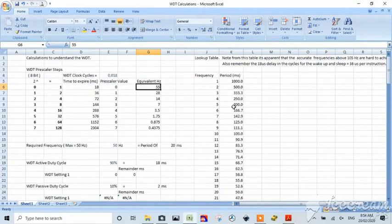So you could keep this going right down to 500 hertz. Let's say we want 500 hertz. So now we've got 2 milliseconds, which is 2,000 ticks of a real-time clock, because they tick over in microseconds, right? So we got 2,000 ticks. We can do a lot in 2,000 ticks.